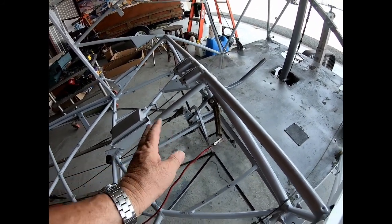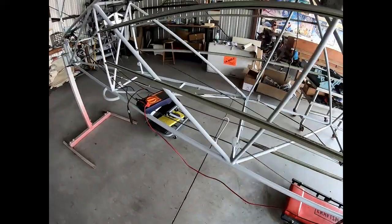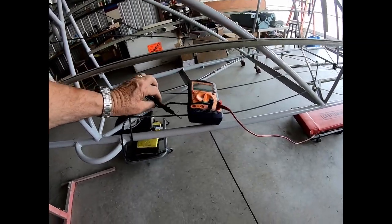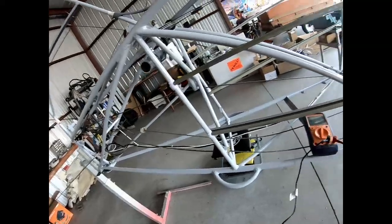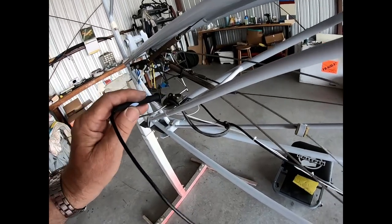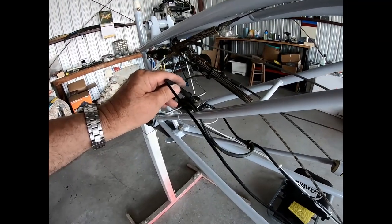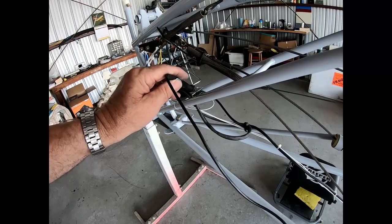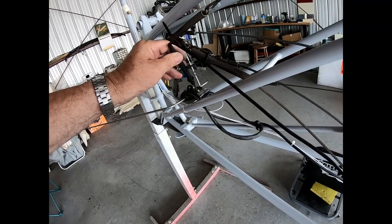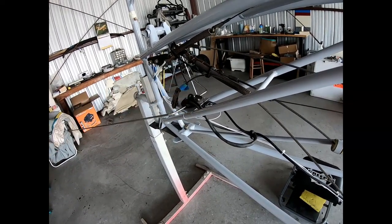And when I do any cables that are ground cables, I then test them. I have this long wire here that I use, and to make sure, let me untie this here for a moment. Get it wrapped around my cables. Before I cover the airplane and then find out I have a ground problem, I make sure that I actually make contact. In this case, when I tested it first, I didn't scrape off enough paint underneath here. So now I have contact, and I can be sure that I will have ground to my taillight and to the VOR antenna before I close everything up.